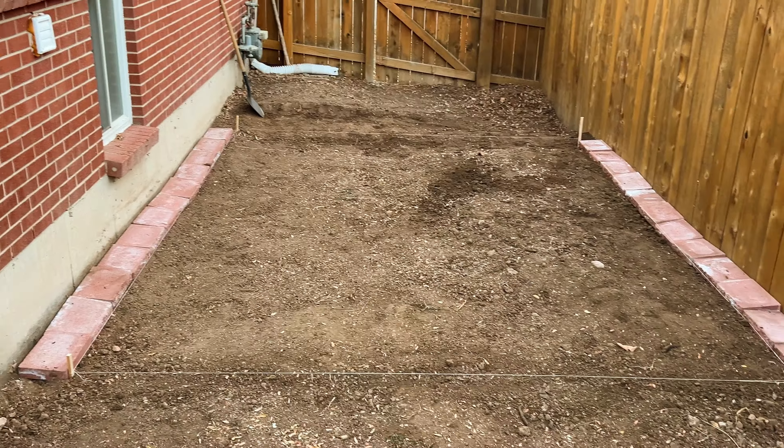I just got the top plates on and I'm marking out the rafters — every 24 inches on center, so I need seven rafters. They're going to slant from the high wall to the low wall, which is only a difference of about eight inches, but it's at least a slope. I already have my OSB and shingles for the roof — everything else is looking pretty good.